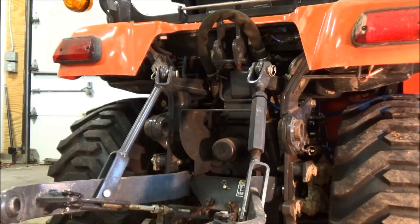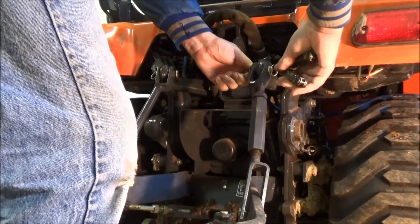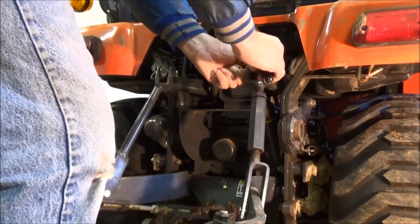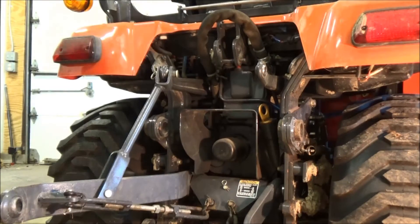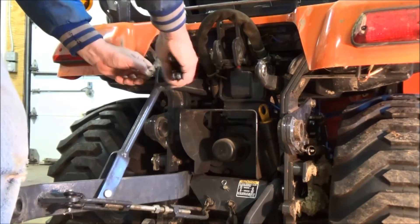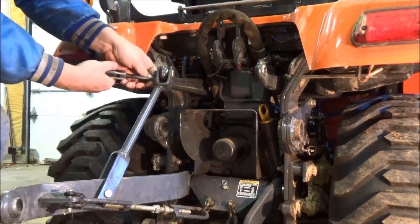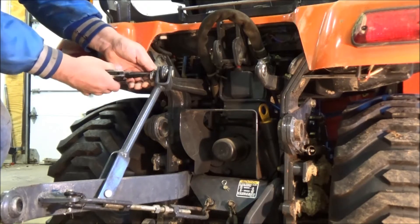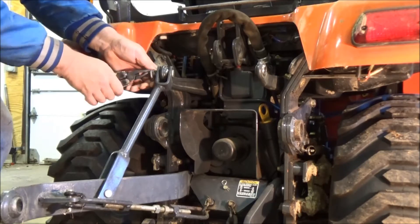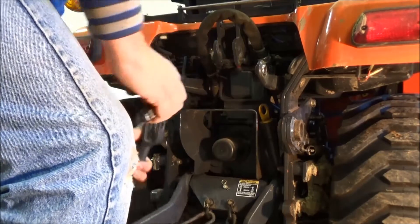To remove the lifting arms, it's much the same arrangement. On these, there's a spiral retainer, at least on mine, which is a little trickier to remove. Let's remove that, take the pin out, and it falls down like that. Set that aside. Same thing on this side. The hardest part is dealing with the spiral retainer — I don't know why they use that. It's almost like a keychain; you just got to work it through, then pull the pin out, and that one drops.